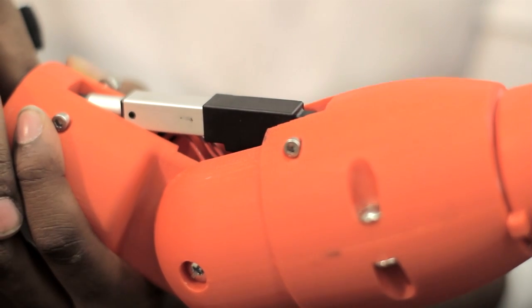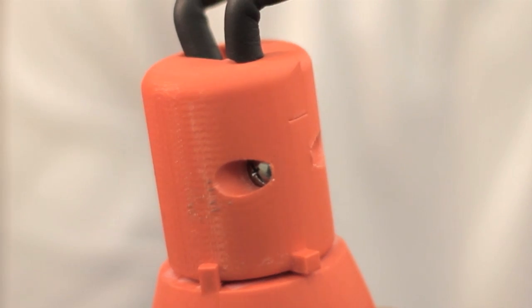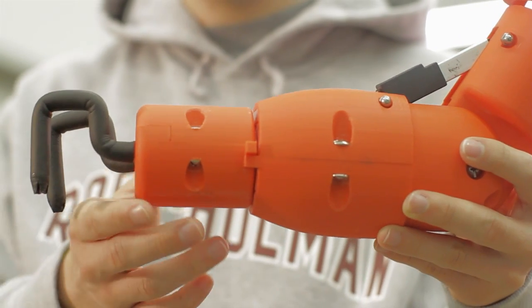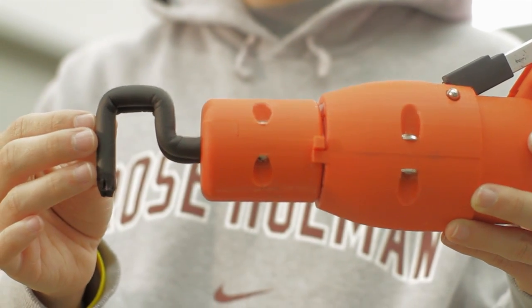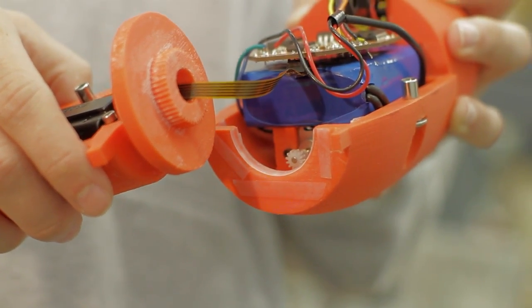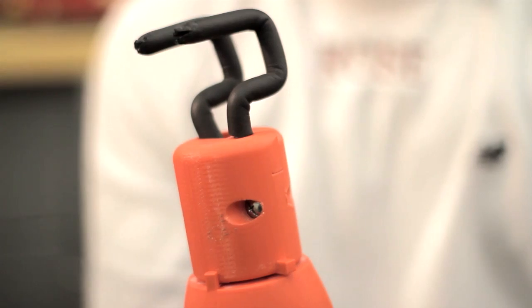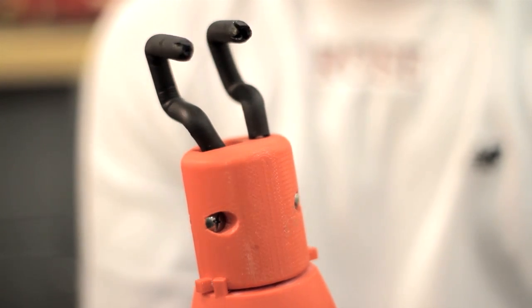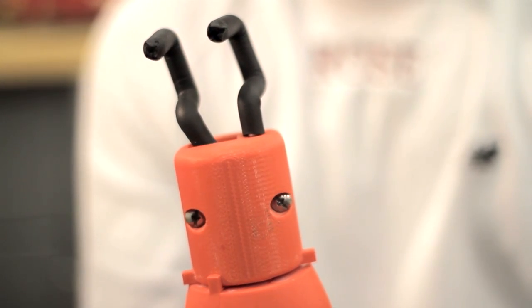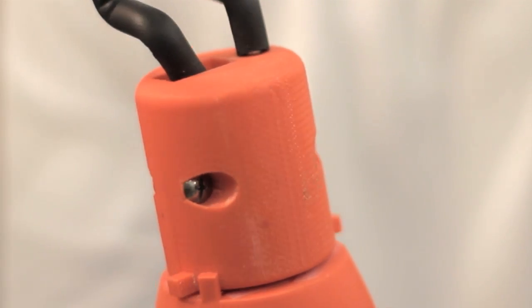This would allow us to have the flexion at the elbow, the opening and closing of the hand, and the rotation of the wrist. After this, we have the wrist and hand subsystems. The wrist subsystem has a gear on the back of it, which interfaces with the gear motor inside the forearm casing. When the gear motor rotates, the wrist of the device rotates as well. There are physical stops on the front of the wrist, which prevent the device from over-rotating and tangling occurring inside of the forearm casing.